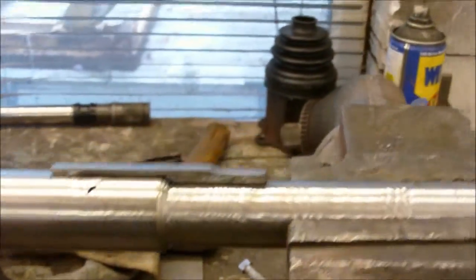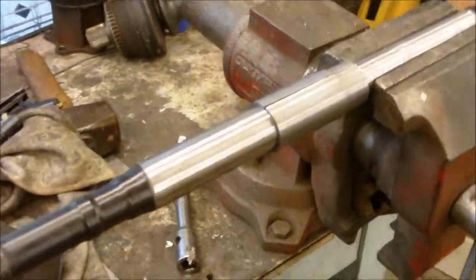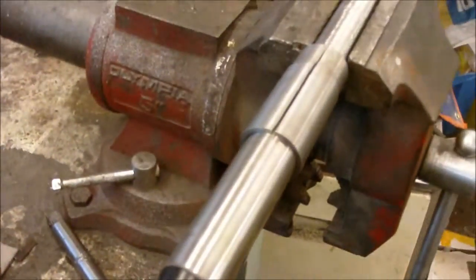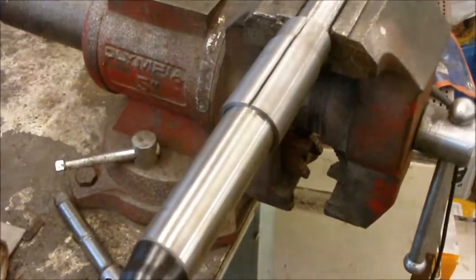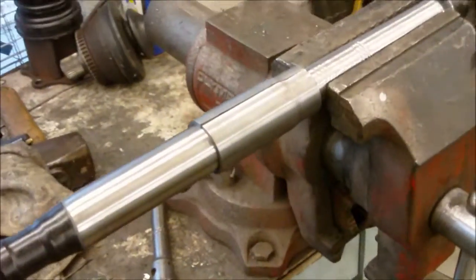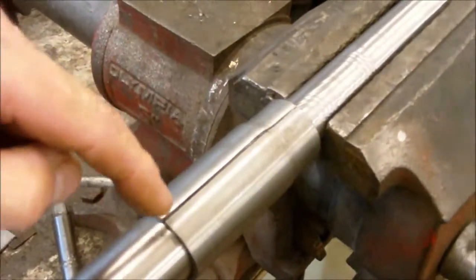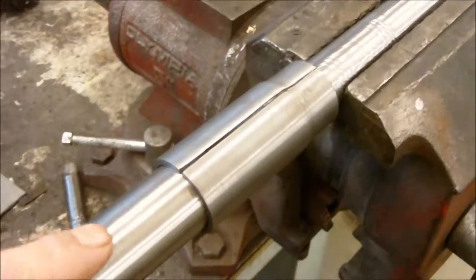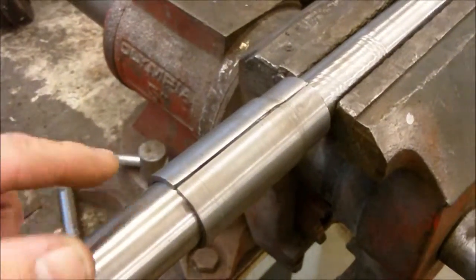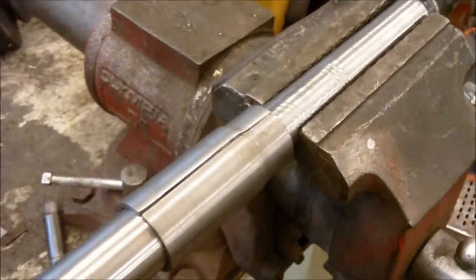Just to give you an idea — that's what I've done with the machining, and that's just how it fits. It's a tight fit, that's why it's holding itself. Now I've got to weld along with the MIG welder, and this side will be high tensile steel arc welding on both sides. We shall show you that in a second.